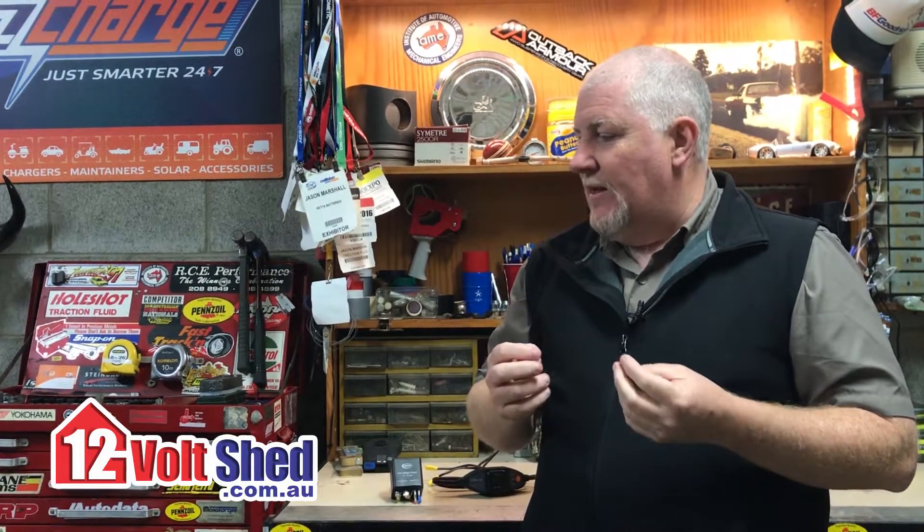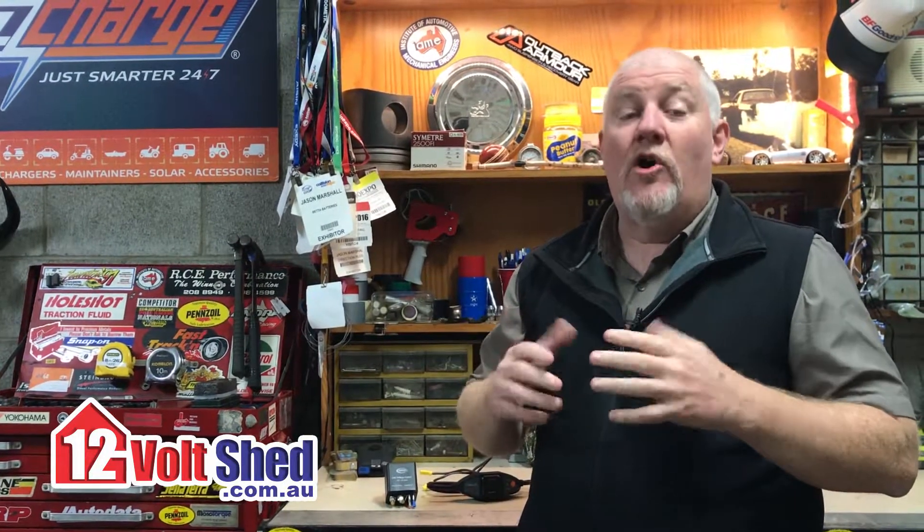A battery has an actual capacity and a rated capacity. If I've got a 100 amp battery for example, it's typically rated at C20. That tells me that if I divide the time into the amperage — so a 100 amp battery at C20 gives me five amps — that battery has been designed to discharge five amps for 20 hours until it hits the international standard for dead, which is 10.5 volts. But the user manual might tell you that you shouldn't take that battery below 11.5 or 11.8.